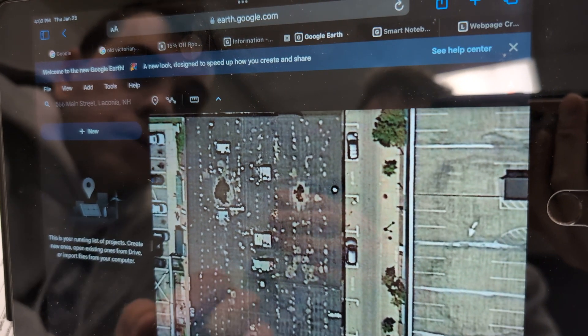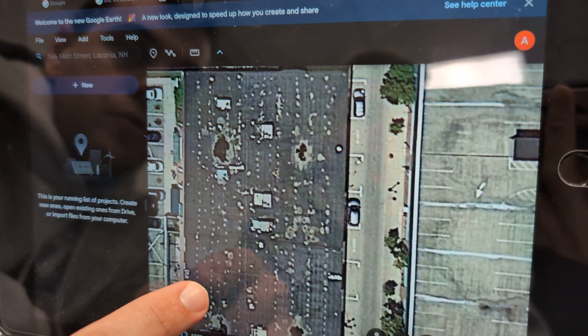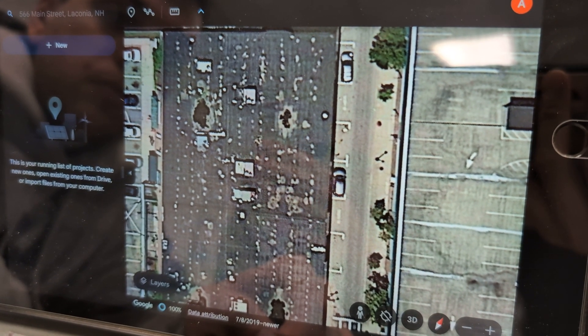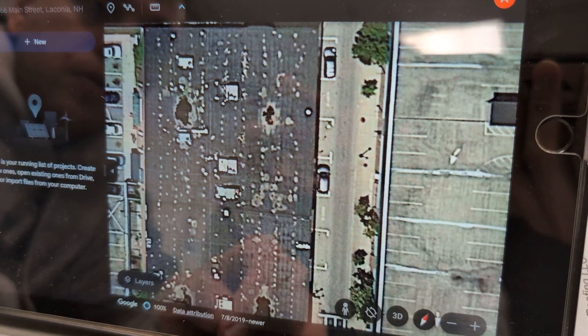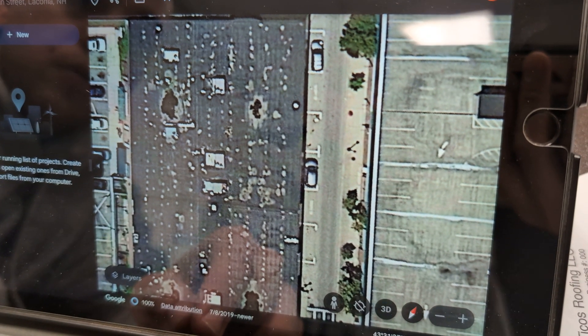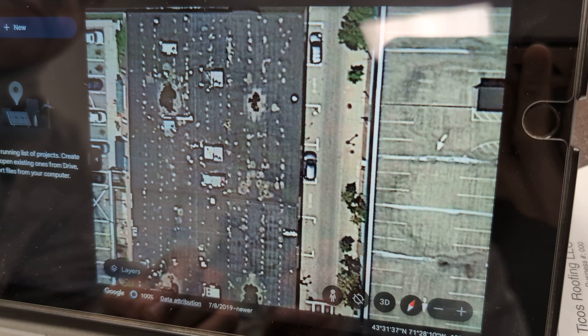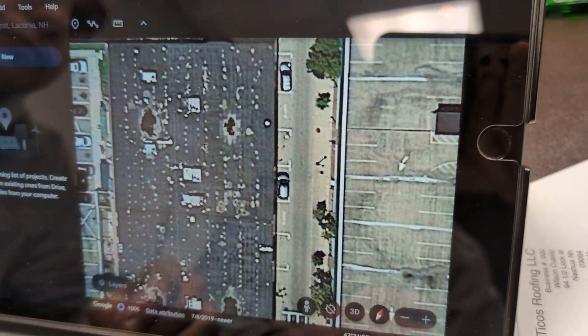All your seams were every 10 feet. When I was up there, that was the first thing I questioned — I was like, why'd they do it like that? Because it's such a large roof. It was about every 10 feet, and it was good rubber roofing — it was EPDM 060 — but the fact that it just gives the roof more flaws and penetration points that it doesn't need.